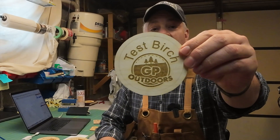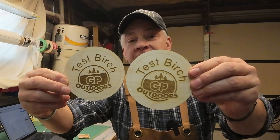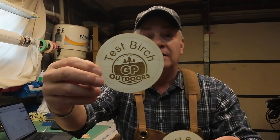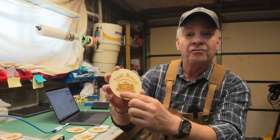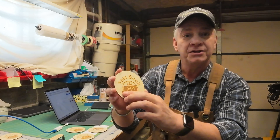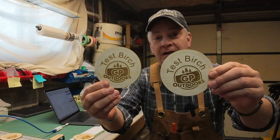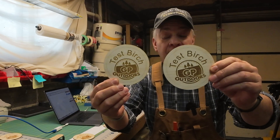This output was at 400 lines per inch, and this output was at 300 lines per inch. You can see the one at the higher DPI with the same engraved settings came out much messier, while the 300 LPI one came out much cleaner and darker — which I prefer because I wanted a nice dark, full, rich look to the wood. The higher DPI left a lot more residue or discoloration from the laser, whereas 300 DPI came out much cleaner, especially around the letters and detail in the design. That's how I landed at 300 DPI.